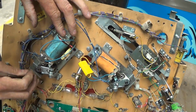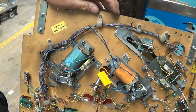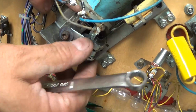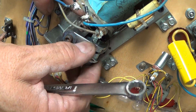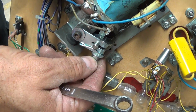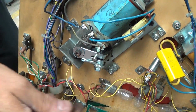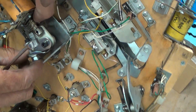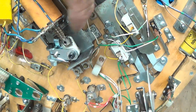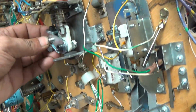Before you take that apart, what else do you look for? Looseness and in what places? Yeah, you can check this. You want to see that there's no play between the armature and the bell crank link, because that represents wear and loss of power. This is slightly worn. You can do it as your own reference. What the Lord is going on there? There's probably stuff loose because hardware wasn't replaced and it either broke or came off.